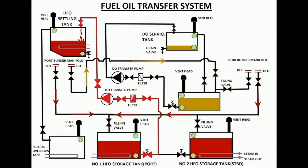The settling tank has a special design by which it can separate water present in the fuel by gravity. This water has to be drained out by drain valves as shown in the diagram. When the high-level cut-out switch activates, the pump stops and the transfer stops. The same operation can also be done in manual mode.